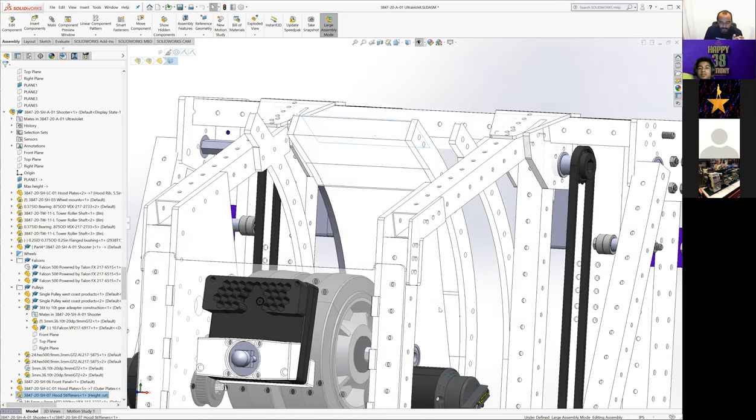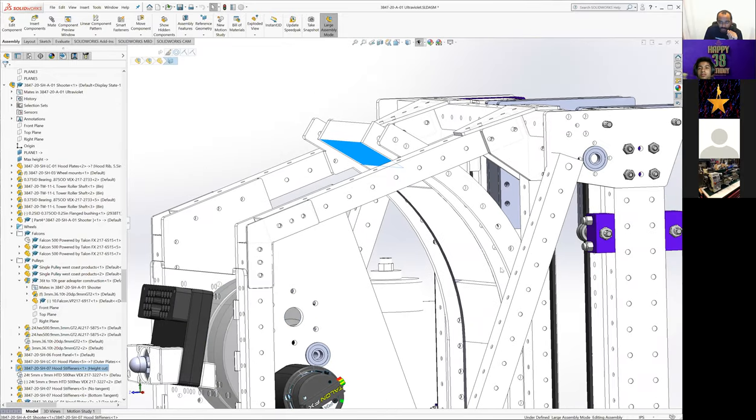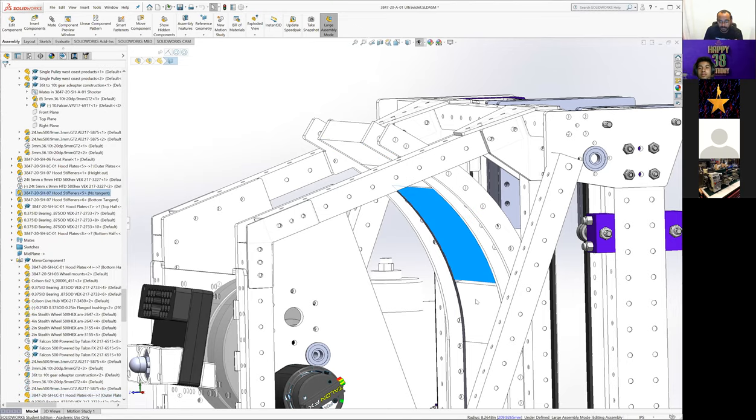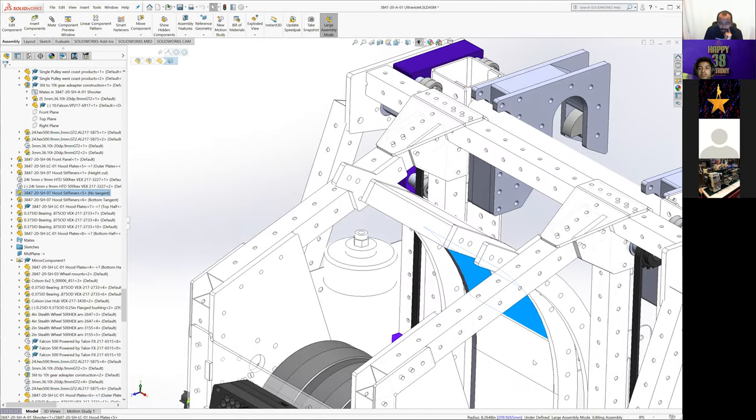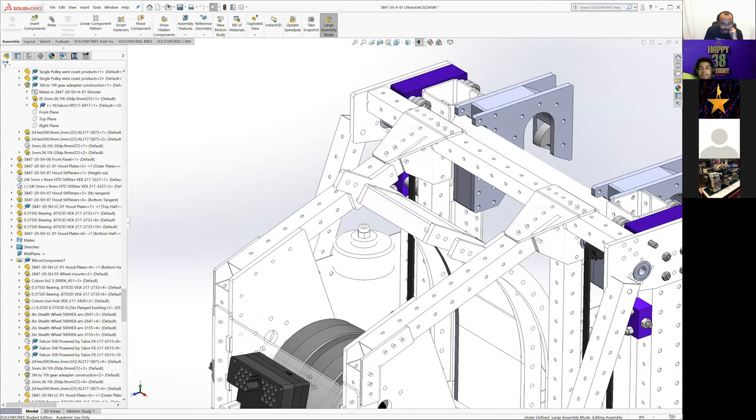So the curvature runs through these 3 portions, and then this portion's actually flat, and it sets the angle. So to actually change angle, you had to go in and change all of these, like change the rails and everything else, which was not ideal by any means either. So ideally, we would have figured out something that let us change and modify this more. We found something that worked and just went with it and tuned it out in velocity. But ideally, had we done this again and made a fix to it, we would have had something that we could have iterated a little bit faster and got real results from. It wasn't as nice as we had planned.